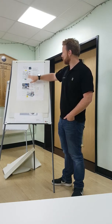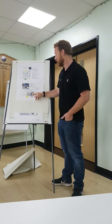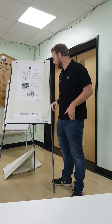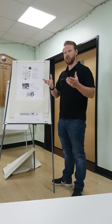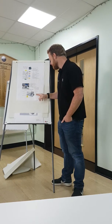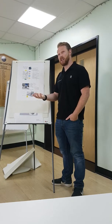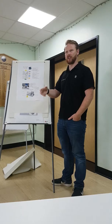Fixed earthed inventory racking is also part of the future state — rather than having all stock delivered to a Kanban location outside the direct working area, moving stock within a protected area would protect the product and reduce associate strain and movement waste. Moveable ESD stock packaging — anything ESD-sensitive generally comes in a black container — would allow free movement of ESD-compliant containers within the ESD area, protecting the product. Dedicated clothing is something they do fairly well, but there are various shoe types which are less ESD-compliant than others. Within a future state, either the selection could be increased or the discipline enforced that a certain type of shoe must be worn in a certain area.